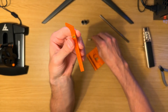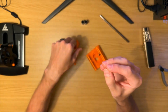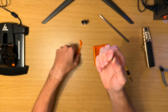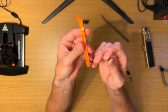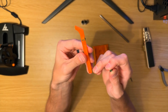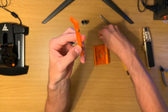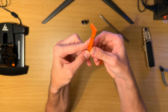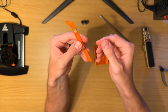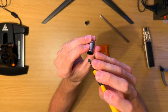Next come our six-by-three millimeter magnets. Orient them by putting them on the slider first, and when you take them off you need to flip them and put them inside the slots. There are nine slots on this, so it goes 10, 20, 30, 40, 50 — that's the position I always install on when I send them out, because that's the detent position people want most. Those magnets are very strong and squirrely; you can go one above or one below as well. Reconfirm the polarity orientation of each magnet as you go.